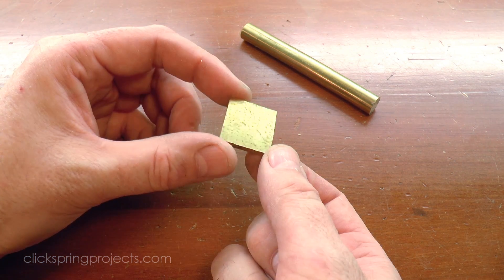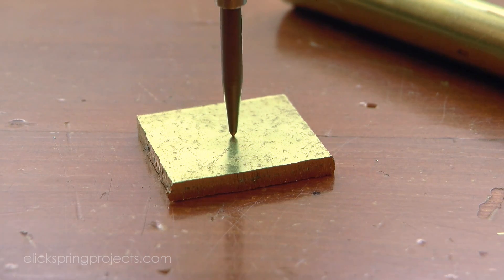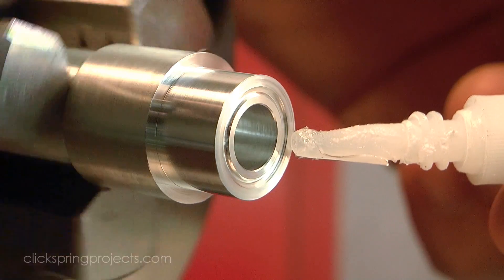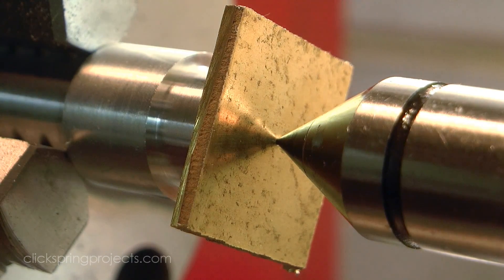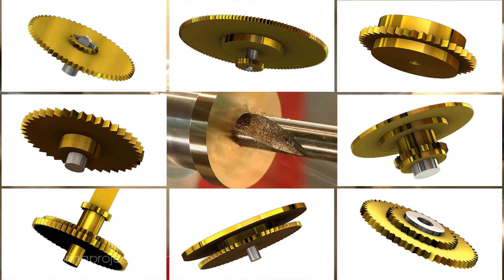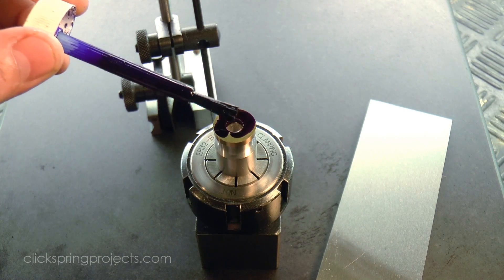Now this fabricated approach may look like a bit of an odd way to construct the part, but it does bring a particular advantage. Because it permits the basic clearances in the device to be achieved simply by using existing sheet stock of a known dimension. It's what I've done for this part, and there are a few other parts in the mechanism where exactly the same time saving trick will apply. I also suspect that this approach delivered an even greater dividend with the more complex sub-assemblies. All throughout the device, virtually every sub-assembly incorporates this idea of spacers and wheels, either riveted together as a sort of layered sandwich, or threaded onto a shouldered arbor, or both. Certainly the wheels and spacers could have been formed from stock selected to achieve a specific clearance, much like this bearing.